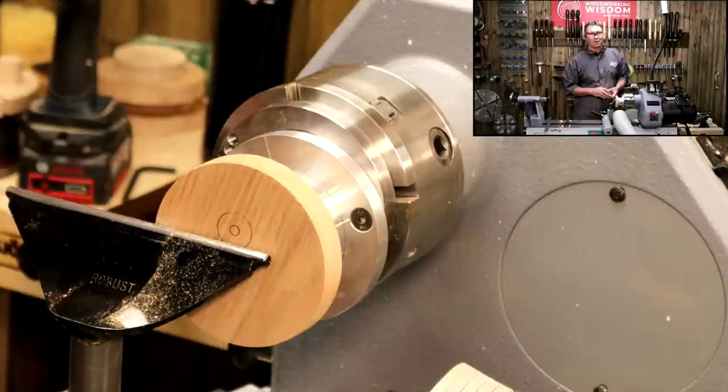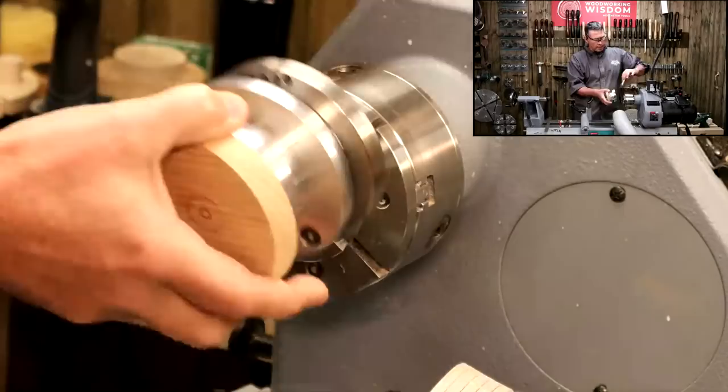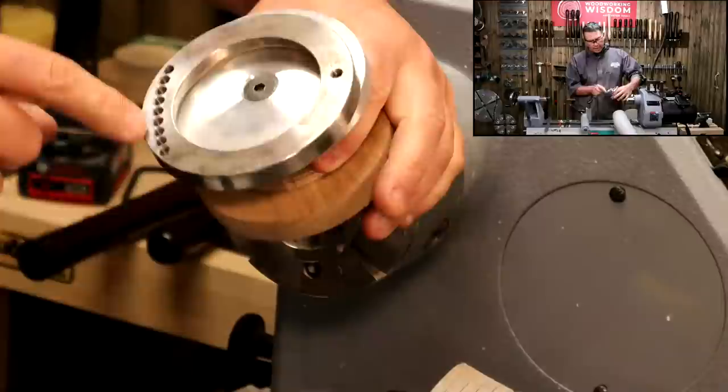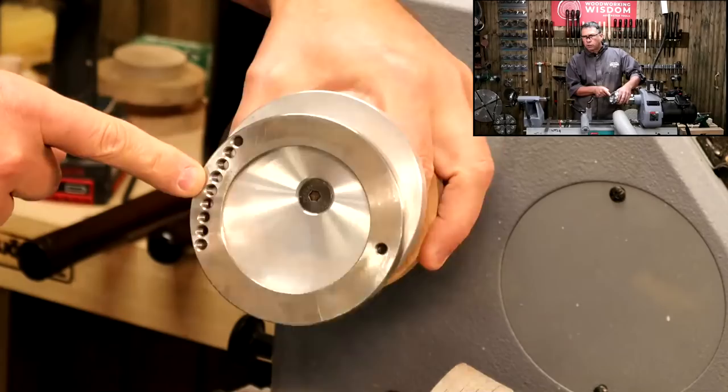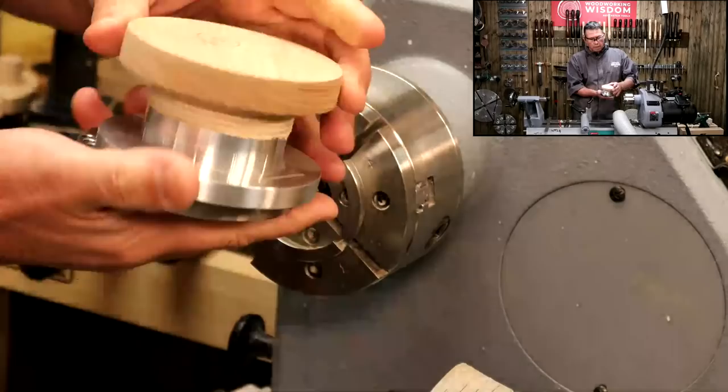What I've done is offset it — I'll take it off the lathe again just because we've had a bit of a hiccup. So that's the eccentric chuck. You can see at the back I've moved it offset — the middle position was here — and I've moved it and locked it back in so it's in its full extreme position to create that first recess.